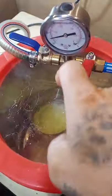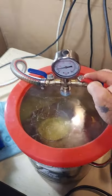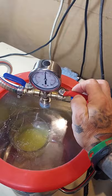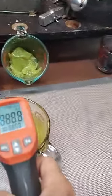We're doing the belly color. So anytime we do a bait, it gets vacuum chambered. Something like this where I've only got a certain amount of cavities — this will get vacuum chambered multiple times. We just want to get most of the bubbles out. It has better clarity and better durability in my opinion. You've got a bunch of bubbles in there, they're connected — you get one rip and it rips the rest of them. So all of our baits, all of our plastisol gets vacuum sealed.